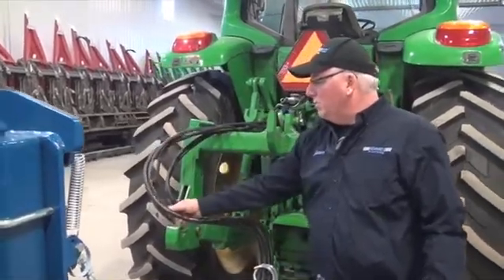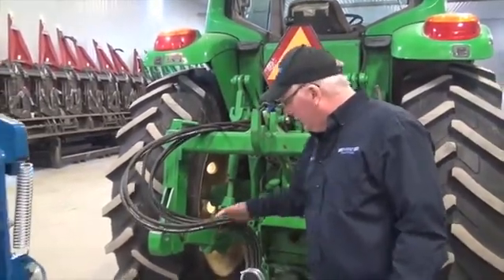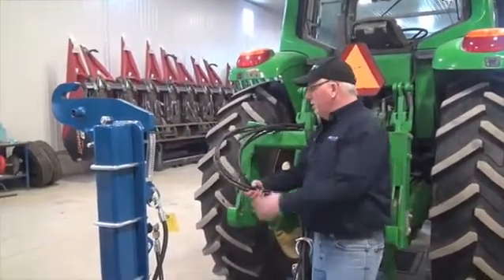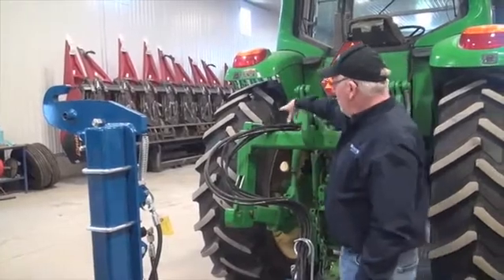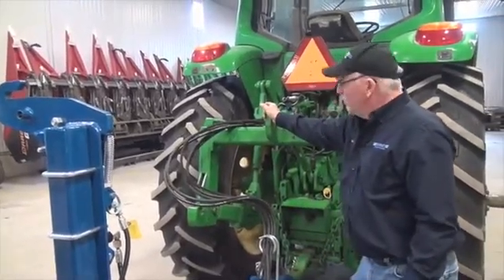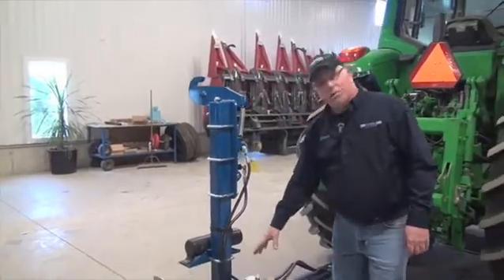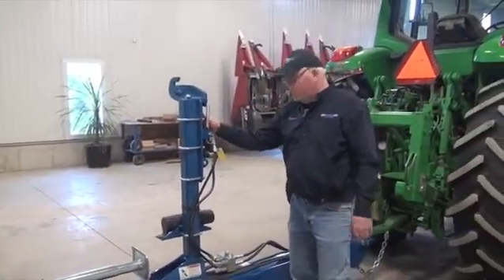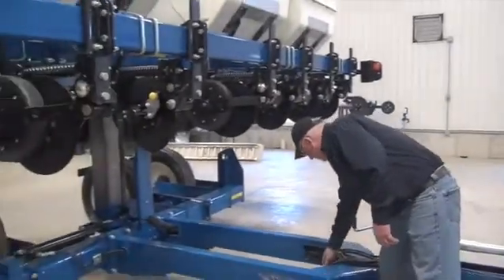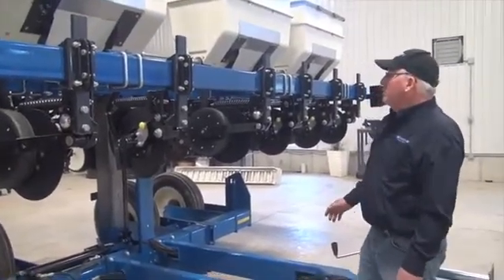Also with the hoses we get the same problem — a blown hose. Most of the time the culprit is something in the three-point hitch, where you've allowed the wires and hoses to get down to the hitch, and when you turn they get caught. One of the things to be conscious of in the wintertime is figuring out how you're going to hook everything up and route everything. In this case we have it all routed up to the top, but to make this even better we could attach a bungee cord and fasten it somewhere to make sure when we turn nothing gets caught. Check for rubs and check for pinch points — we don't want anything that could get caught in the springtime.